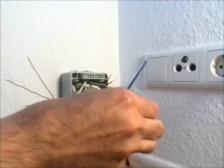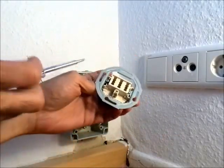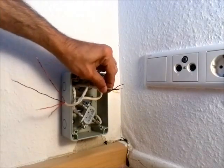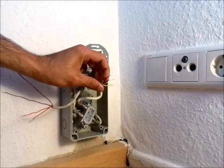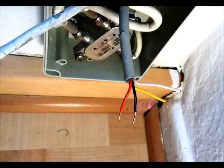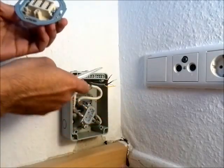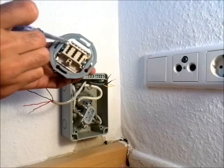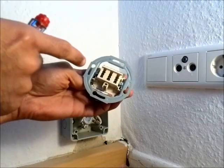In order to get signal on the F pin, we have to connect the DSL cable, which is gray in color. If you remove the gray layer you might find four thin wires in red, black, white, and yellow. We have to connect the red wire and the black wire to pins one and two — red goes to one and black goes to two.